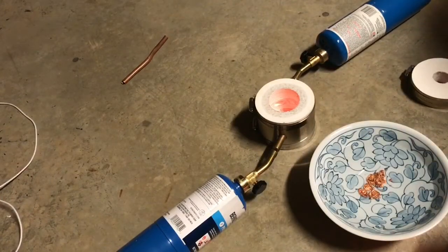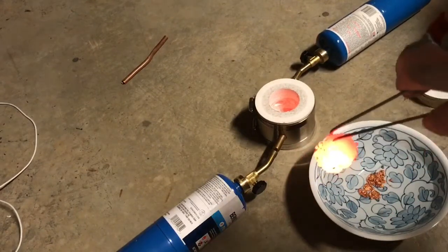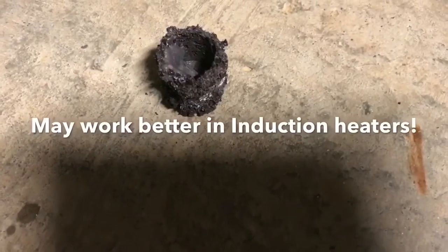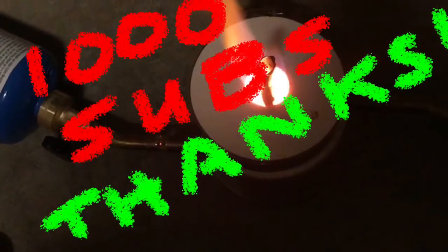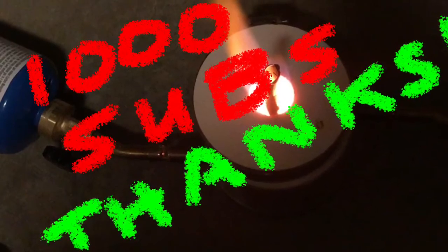The graphite crucible is not looking too healthy — it looks like it has become damaged by the heat. It's half oxidized and irregular. We'll take a look at what that looks like once it cools down. Here's our end product; it looks like the flame was too oxidizing. In summary: the Quick Kiln is economical, easy to set up, and good for small loads. The cons are difficulty controlling temperature, small sample sizes, needing two torches to run it, and the supplied graphite crucible gets eaten up.